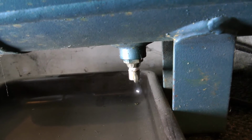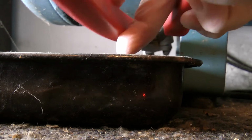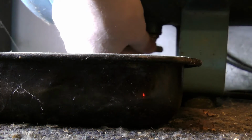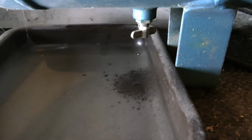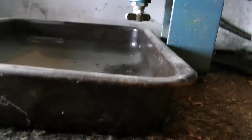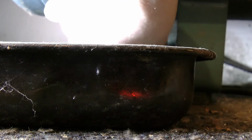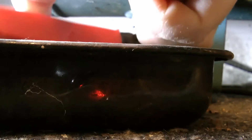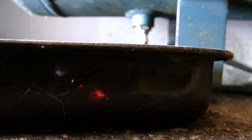So I'm going to start by draining the water. Right, you can see the drain cock now. I'm going to take my pliers, get a good grip, and turn it, and the air is escaping now. So now I'm going to tighten it. It's probably not as bad because I've done it recently and I haven't used the compressor much. Right, so that's job one, nice and easy.